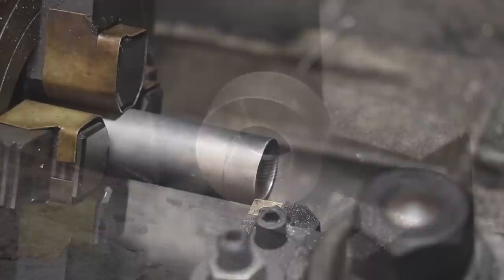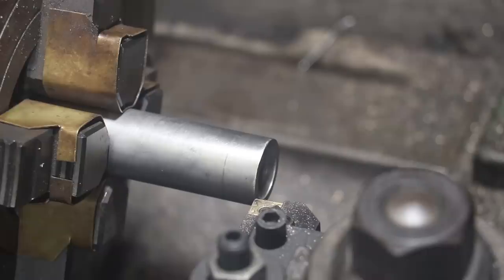So we got the shaft in here now. We're getting this ready to start cutting the external threads on it. But before we do, we got to finish this little end. So this needs to be faced off. And again, what does that go in? 550 thousandths deep, and make it 0.875 in diameter. So let's go ahead and get that cut out.